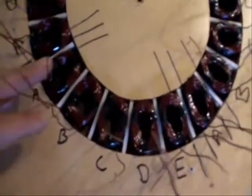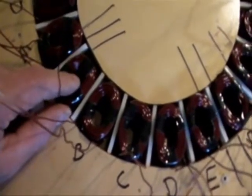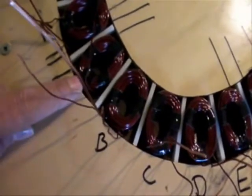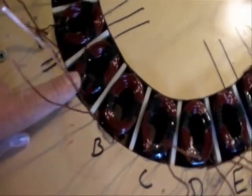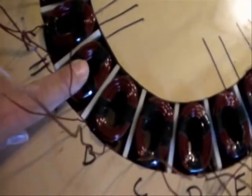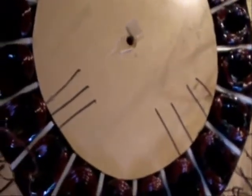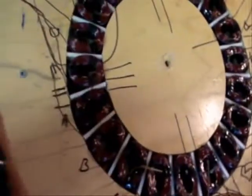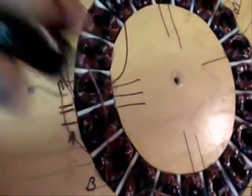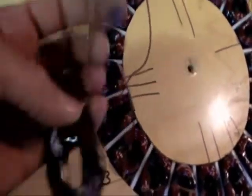So what I've done, I'll explain that on a piece of paper like I usually do. I increased the depth of it. So instead of a half an inch, I put a 16th of an inch more here, so it's a thicker coil, and I was able to put back the 100 winds that I took out from the other ones. These are half an inch, or they sit inside of half an inch, so a little less than half an inch. These ones are a little bit thicker, so I managed to put 100 winds, same as this.